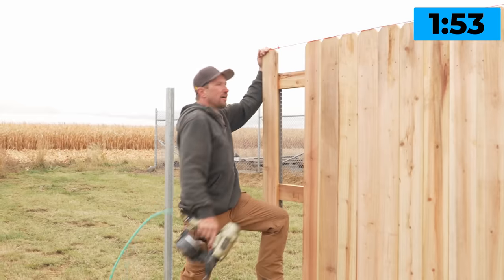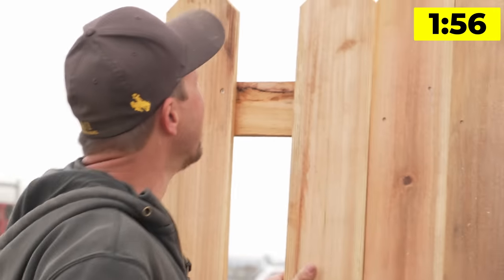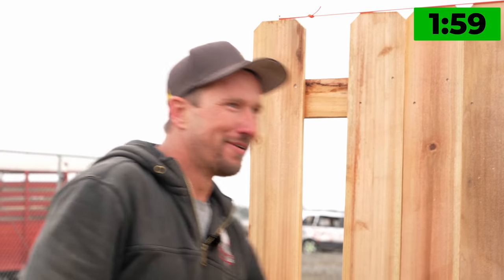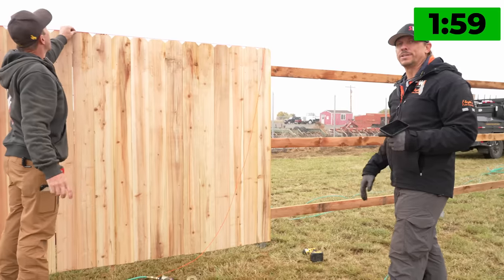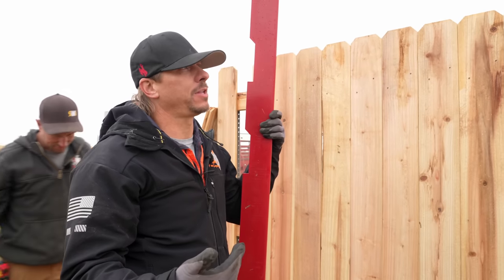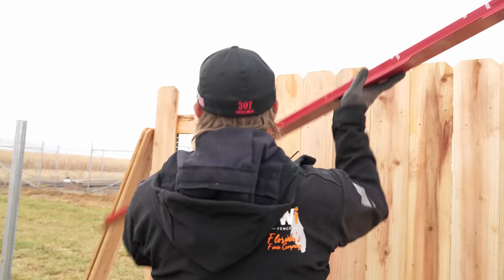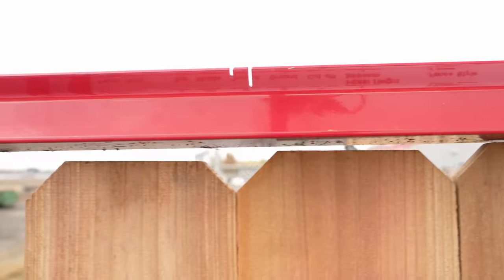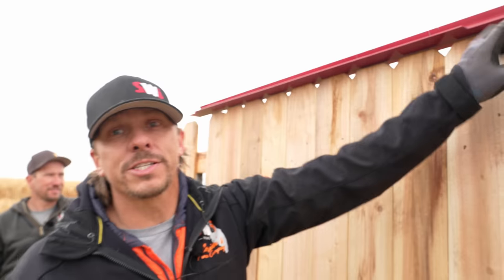You need another board. You just ran out of boards. So I might have one that's just a touch high. This is such a joke. I expected you to actually take your time and try and get them right. I don't really care about nailing all that stuff because that's just a speed thing. Anybody can nail these rails. Let's just see here. You can clearly see that we're way higher here and you can see how these boards are not straight. I was watching him constantly push that string up and up and up, so it just kind of worked its way up and he's probably three-eighths high right there. Then this is a little low, and this one's high, and over here we're a little low. This is not the way to do this.